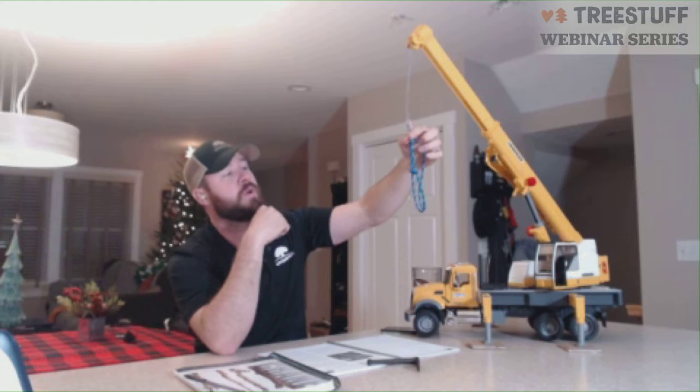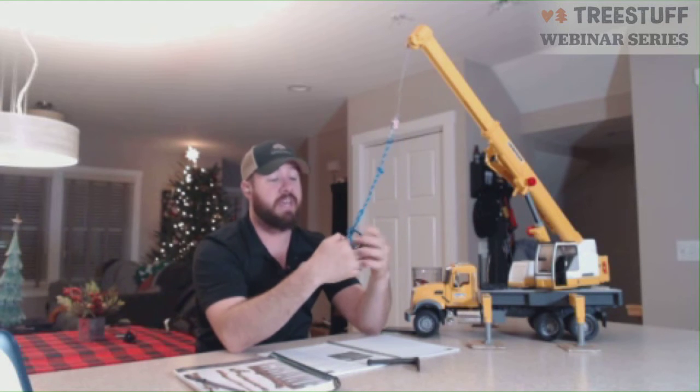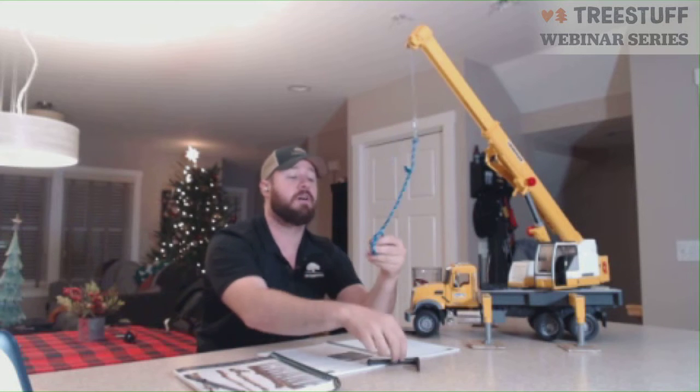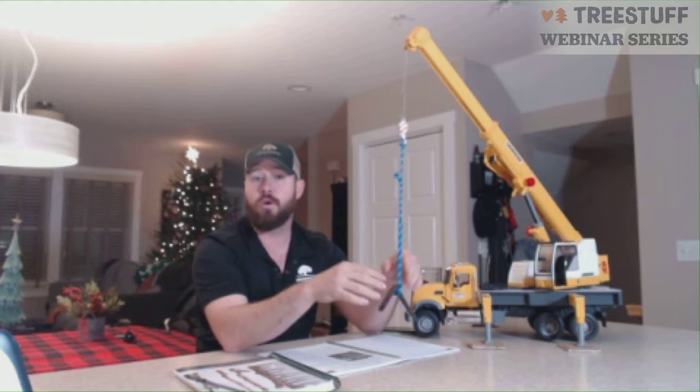So the majority of what we use our slings for is in the choker configuration. Either it be using a regular shackle to choke something back off, using a soft shackle, using a knot of some form, be it a running bowline, a closed clove, something like that. Some way in which you're creating a bend on the rope at one position, one termination, that's considered a choker.